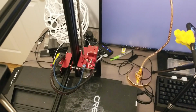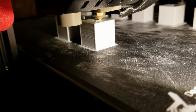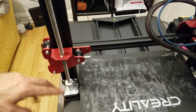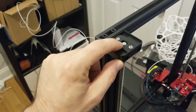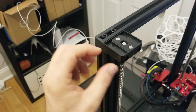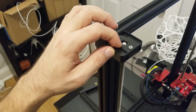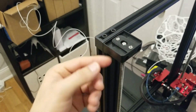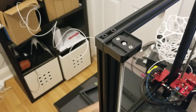And this is the second time I'm doing this, and I took my time with it because I wanted to get past the 7mm mark where I'm getting better printouts. And after that, I adjusted the motor, the screws here, I loosened it and I repositioned it just a tiny bit to make sure that the tip of the rod at the top here will stay in this vicinity where the bracket is, so it doesn't put any tension on the ball bearing, because the rod tends to kind of screw in the edge of the ball bearing, which creates a bit of friction and creates some of the bumps that you may feel when the X-axis is going up.